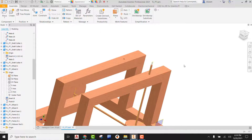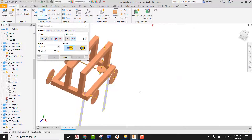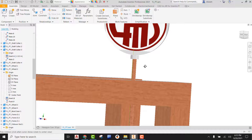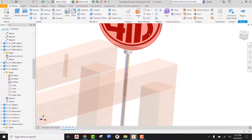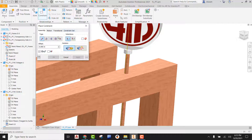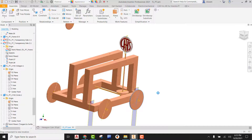The last part of this would be putting the topper on top of that. So I can go to constraint, insert. I'm going to flip this over, looking at the inside of the hole, down at the bottom of the hole, and pick on that. Then flip this over and look at the top of the follower. We can see how that went in together — hit apply. The thing is this is able to spin independently from this, and they're going to be glued together in real life. So let's fix that. Double clicking on the topper, coming down into origin, finding a plane that goes right down through the center of it. I'll turn the visibility on and return back. Now I can use my mate constraint and put a mate constraint between this work plane and this work plane. Hit apply, cancel. Now when I sit back and look at this, we can see that that is working.